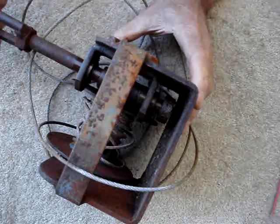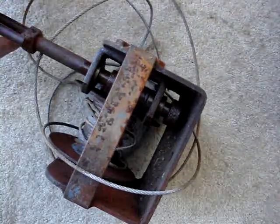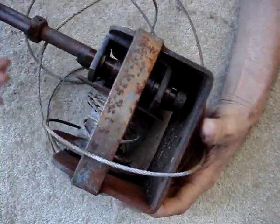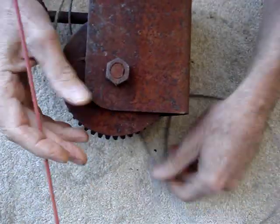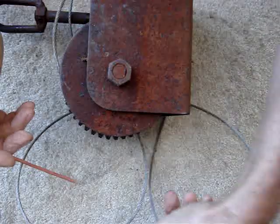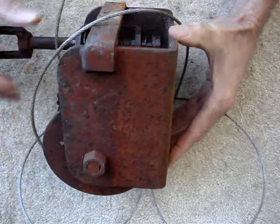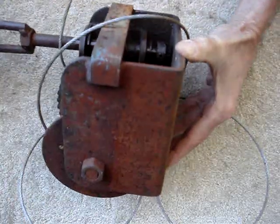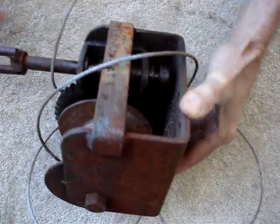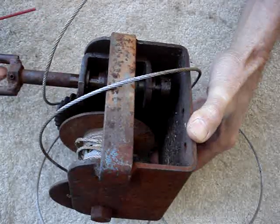Here's what I've decided about the end-play issue. When this thing is pulling, it feeds the wire rope — it looks like a tangled mess of spaghetti but it comes out this end and feeds on this way. So the load is on the drum this way, and the worm stays in the same place, right about in the middle.